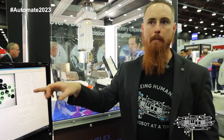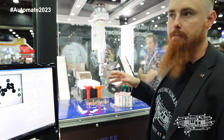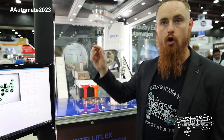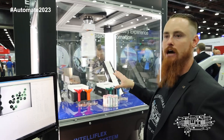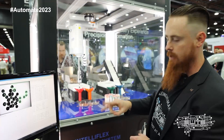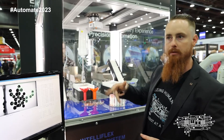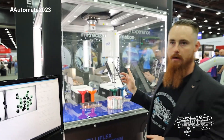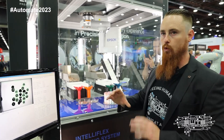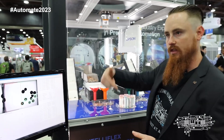I'm not positive if this gives any type of pathing or just one singular position where the robot handles its approach positions. A lot of bin picking type softwares now give entire paths to the robot, telling the arm exactly how it needs to orient when picking up the part. This is 2D vision, so I highly doubt it's giving any pathing data. 2D vision means you're taking a picture of one dimension and not capturing a three-dimensional item with yaw, pitch, and roll where the robot has to pose its arm in a special orientation.